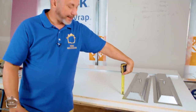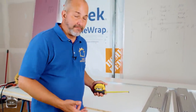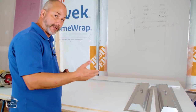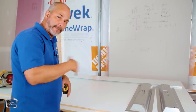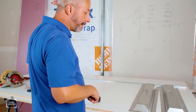And if you can check that out, it's 2 inches thick. No big surprise, right? So we're gonna make our countertop 2 inches thick. Makes everything really simple. So we're gonna use a sheet of melamine as our base, which will officially be the top of the counter. And then we're going to use the second sheet of melamine to cut the material that we need to create our form, okay? So we're gonna go with 2 inches as a rule.